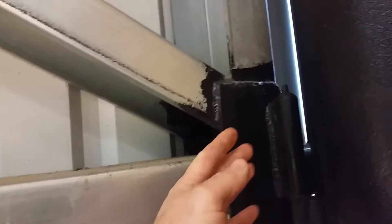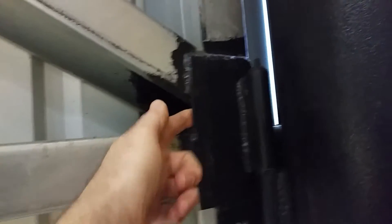The hinges on the posts are bullet hinges for wrought iron gates. These are large — they have three-quarter inch pins. Six-inch galvanized purlins. I plated the joints where the hinges attached to the doors — that's a quarter inch plate. I put a little plate under the hinge to reinforce those 14-gauge purlins.